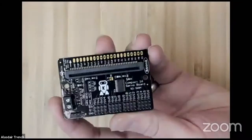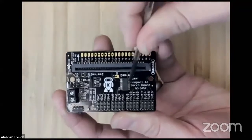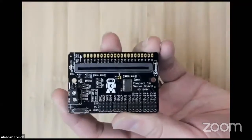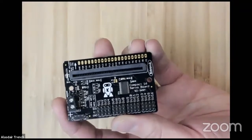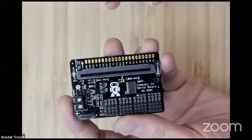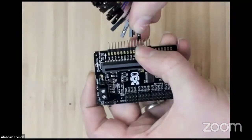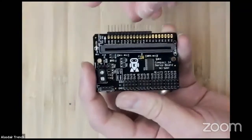That chip drives all 16 servo outputs using the micro:bit's I²C communication bus — the same bus used by the micro:bit's accelerometer and other onboard sensors. That means all other pins apart from 19 and 20 are available for connecting input sensors or other outputs like LEDs or speakers. You can solder vertical or right-angle pin headers at the edge and use jumper leads to plug things in really easily, rather than having to solder and desolder every time you want to change something. That's a great way to add extra features to these boards.